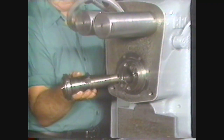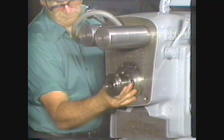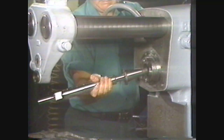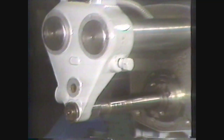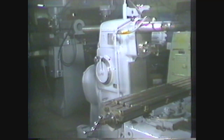There are two styles of arbors. The short arbor, called the stub arbor, holds and rotates the cutter without the over arm support. The long arbor uses bearing collars and the arbor support; the bearing collars ensure the correct fit in the arbor hole of the support.